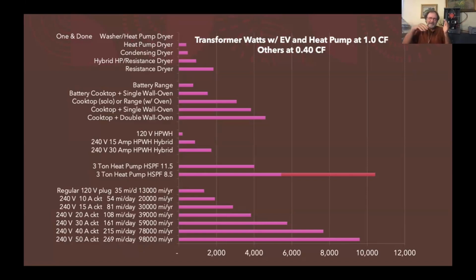I don't like those. They take up too much power intensity on the panel. And so I want to leave that space for other things that are more important to me, because I really don't care how long my big tank water heater takes to reheat itself. I do not care. What I care about is we get all the hot showers we want when we want them. And that we do with a bigger tank and a mixing valve. So we've got ways to meet our needs.